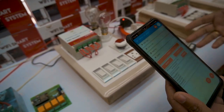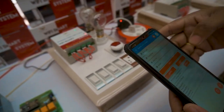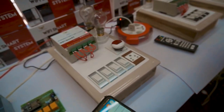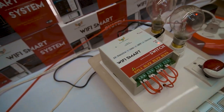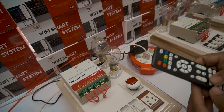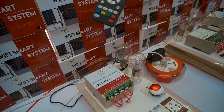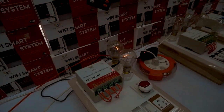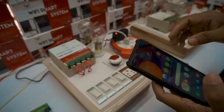Now I am disabling this device from the cloud. In India, you may sometimes face internet issues due to traffic. In that case, we switch the system to AP mode — also called remote mode — so the system is disconnected from the router. We are also providing the IR remote, so you can still operate from it: relay 1, 2, 3, 4. You can switch on or switch off all loads at once.